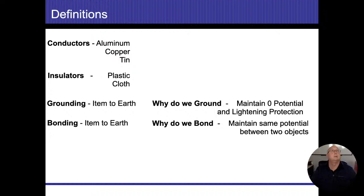I'd like to address a little bit about these. So aluminum and tin, a lot of people get confused between the two of them. Now, they're both going to be silverish in color when it comes to looking at the actual metal portion of it. Aluminum will be a little bit shinier and newer, and I know I have a picture of it here when we get later on into the slides. But the biggest detail and the easiest way to tell the difference is going to be that aluminum is always going to have the plastic insulation.